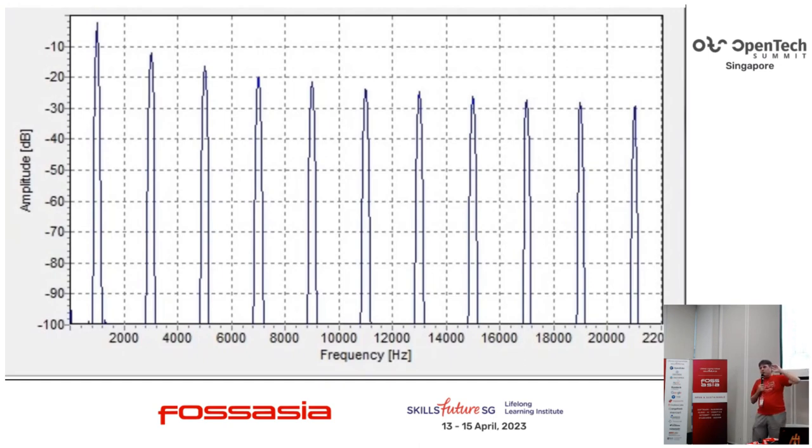But what I'm saying is, it's not enough to know how much power comes out of the socket. You do need straight away to analyze it by frequency. The harmonics are relatively easy because the filters are not terribly difficult. Whatever your fundamental is, you can readily build a filter that goes 10% either side. And then you can move that up: the first harmonic will do that, and then the second harmonic will do that. And so you can get your spectral breakdown pretty cheaply in software without any complicated maneuvering. That's a really important test, and it's a regulatory one, not a usability one. And fortunately, that's relatively straightforward.